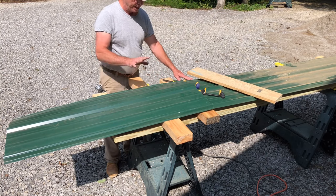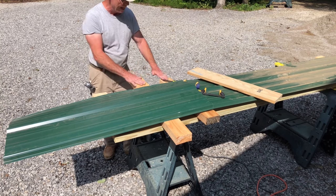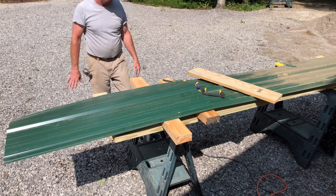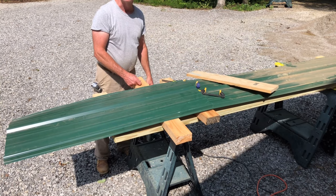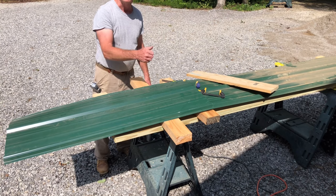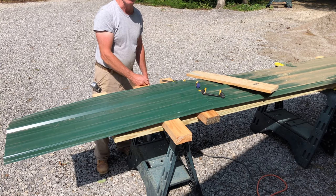So to go through it again: put down some two-by-fours on a couple of sawhorses, spread them out where you need them, get a couple more two-by-fours to lay on top to create the ladder effect all the way across your entire piece of metal to keep it nice and straight. Get yourself a nice straight-edge board to use as your rip fence and pretty much that's it — that simple. Just a little tip from the Clear Creek Cabin when you're cutting metal. Stop in and see us again, give us a subscribe and a thumbs up. Take care folks, God bless you till the next time we see you.